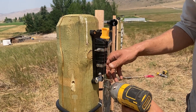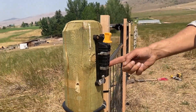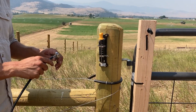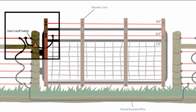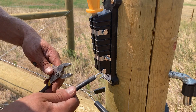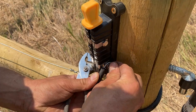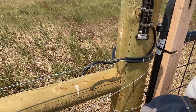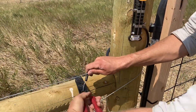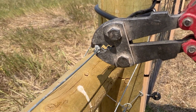There are many designs of cutoff switches, but they all do the same thing. When the switch is closed, it allows the fence's power to flow through. When the switch is open, it breaks the line and cuts the power. We are using a simple blade switch for this fence. After installing it on a post with screws, we'll run a wire from one side of the switch to the hot wires on the fence, and a wire from the other side of the switch to the hot wires we've offset from our gate. Secure the wires with taps on the gate and fence.